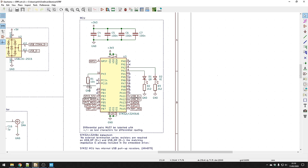We also have the BOOT0 pin, which I pull low. The boot pin determines if the bootloader is started. I'll be programming via SWD and not using UART or USB to program the STM32, so I can pull the boot pin low. If you want to use USB or UART to program it, pull it high or make it variable with a DIP switch. If you're just going to use SWD, pull the BOOT0 pin low with a 10k resistor.